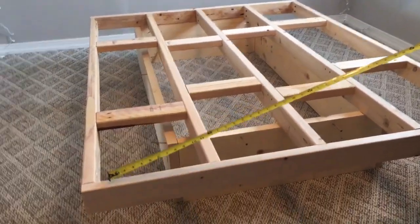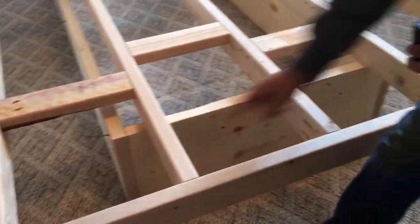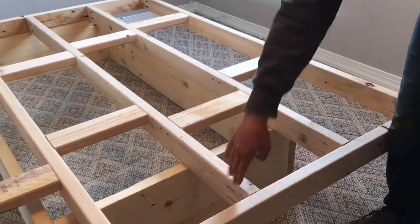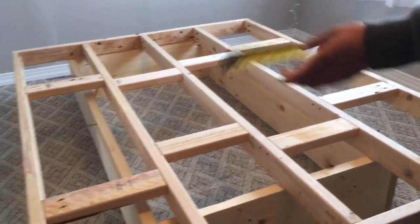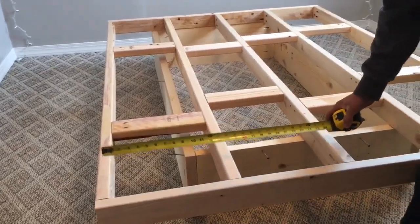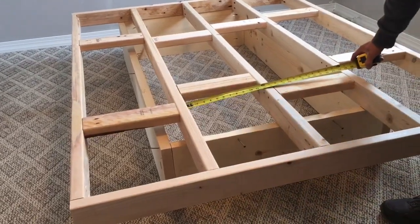Mark on this face 2x4 — divide your distance up equally and mark where each 2x4 goes. Then after you put all these 2x4s in, measure in between and cut each space or length. They won't come out exactly the same — this one's 12 and 5/8, this one's just 11 and 3/4.